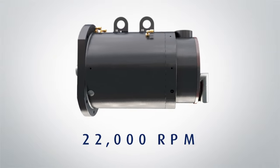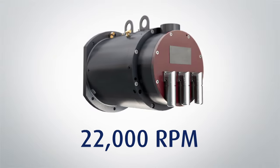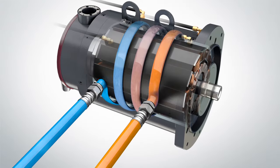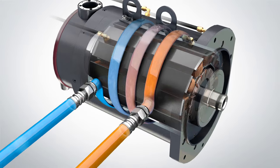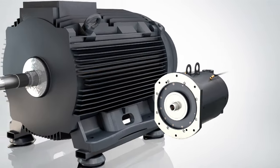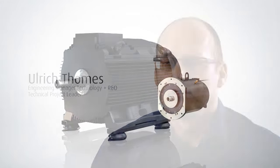It spins up to 22,000 rpm and provides efficiency levels above IE4. It's a water-cooled unit, making it quiet and easy to recover heat from. It's also ultra compact when compared with traditional drive units. Put simply, we believe this is the best compressor drive technology available today, and perfect for a pioneering product such as Ultima.